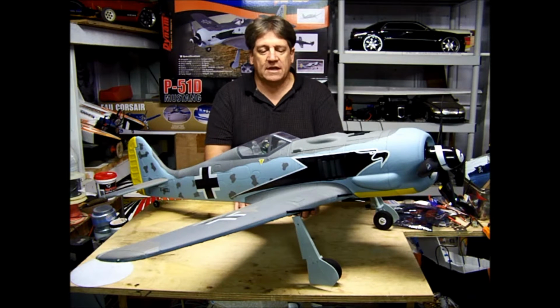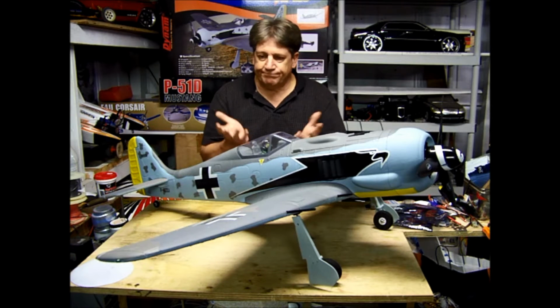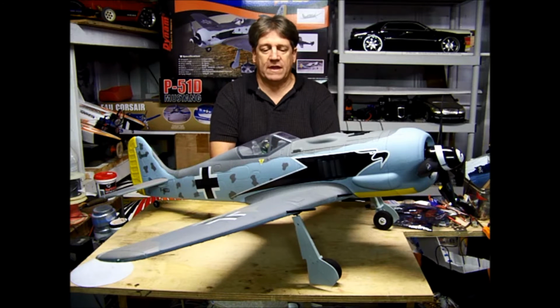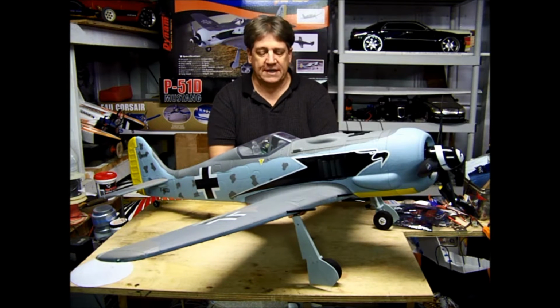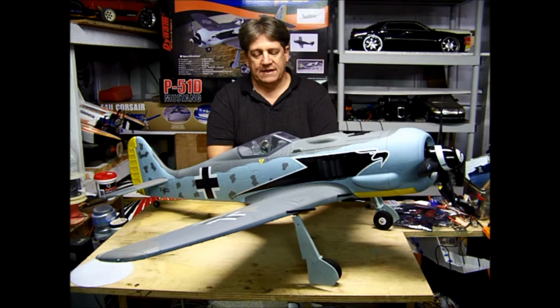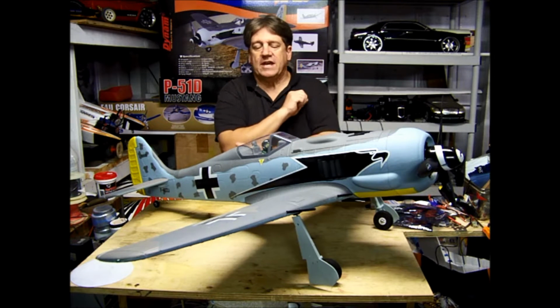It was doing the same thing, and this went on for almost 2 weeks. I sent Motion an email. I explained what it was doing and what procedures I went through to try to find the problem, and asked them if there was something else they wanted me to try, or what their thoughts were. My thought is that the electronic speed control, the BEC, the battery eliminator circuit in the electronic speed control, was bad. I was getting either RF interference out of it, or possibly inconsistent voltages. I wasn't sure which. I tried running voltage tests on it, but I couldn't get the problem to happen while I was doing a voltage test.